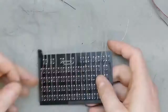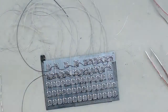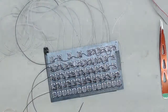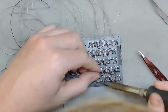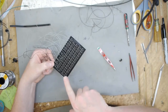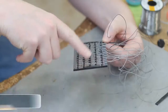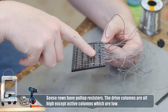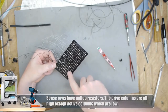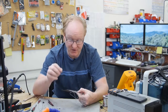The columns are done, and now the rows are done as well. I finished wiring up the switch matrix — we have the rows or sense lines going across into the diodes, and then the columns or driver lines going vertically. That's how it works when you push them.